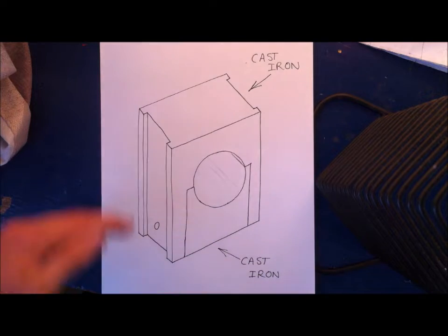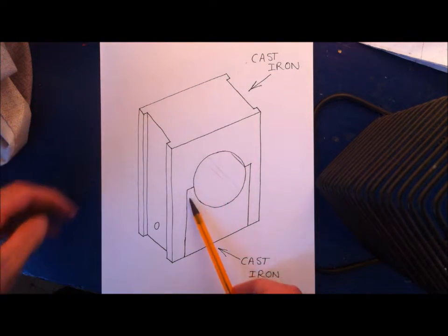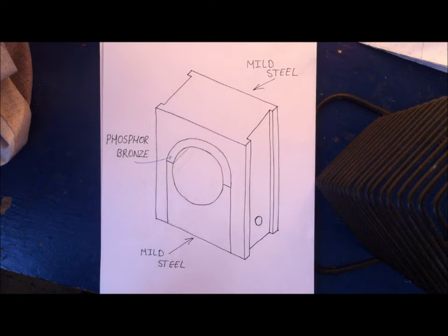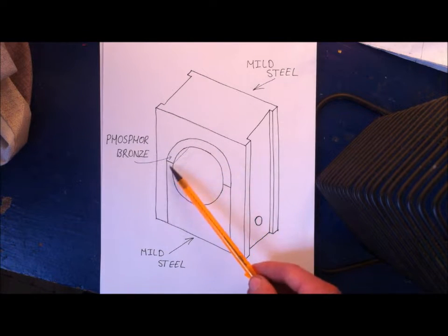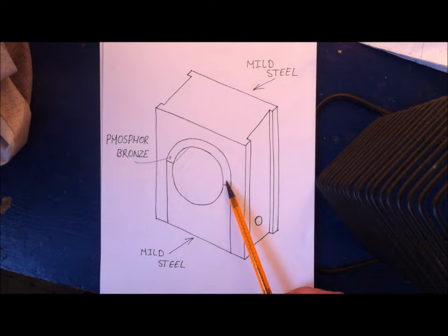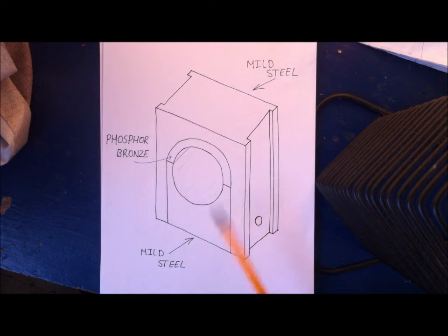All the weight on this is from above, so only the top half actually contacts the bearing. The way I've made mine is to fabricate them from various bits, so the outer shell — the main body — and the actual under-keep are going to be made of steel, and the bit that has to do all the bearing work is going to be made of bronze. This does make it a bit more complicated because you've got to factor in an extra piece. I've enjoyed the challenge, but whether I'd do this again or just buy the cast iron, I don't know.